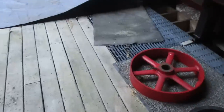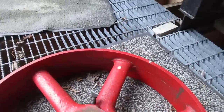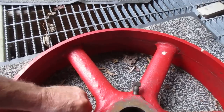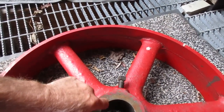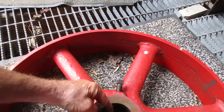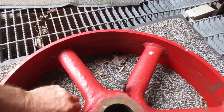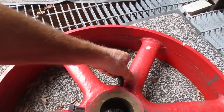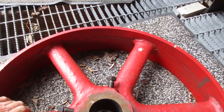The reason that I did not put this on, one gentleman was asking, I don't remember names, but he's a regular viewer, is because I want to put a key set in this before I go putting it on so it won't spin. If you just bury those down in the shaft, it's just going to destroy stuff. So I'd rather have it go down into a keyway and destroy the area around there.